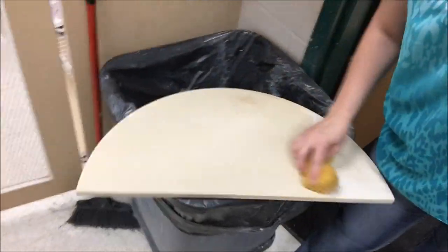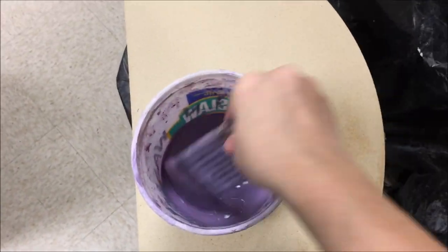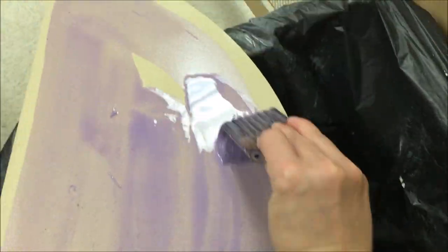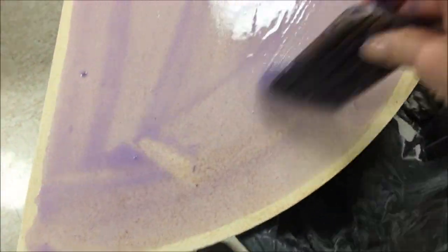This is a raw shelf that has not been fired yet with kiln wash, so this one will have its first application, and it takes a little bit more when you're first applying it. This might be two, three, or four coats the first time that you've fired a kiln shelf. Note that I'm keeping it about a half an inch away from the edge.